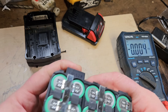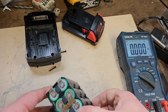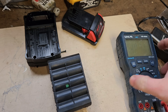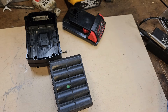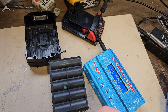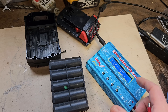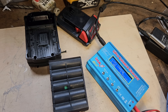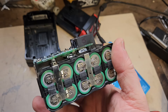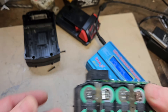So the middle bank of cells is showing less than a volt. I can bring these back from the dead. I can use this B6 charger to bring them back. But what I'm going to do after that is check how good the fix was. I used to just have a wait-and-see attitude to this.